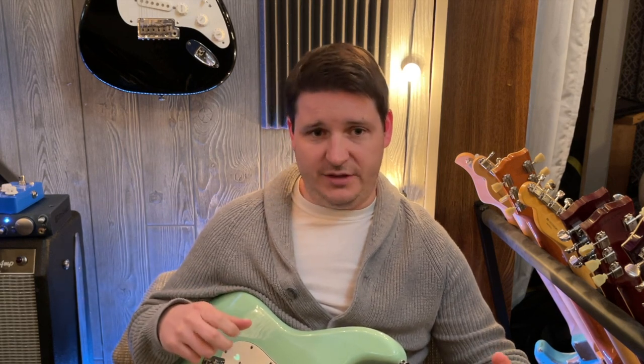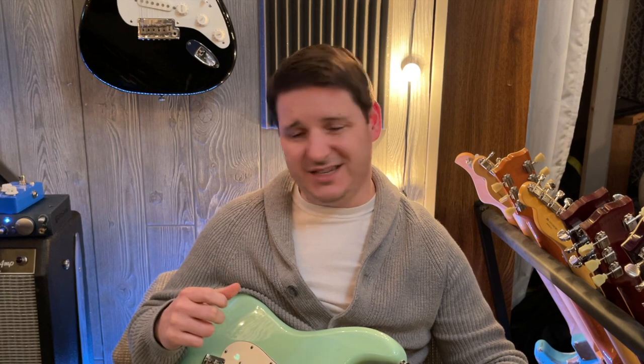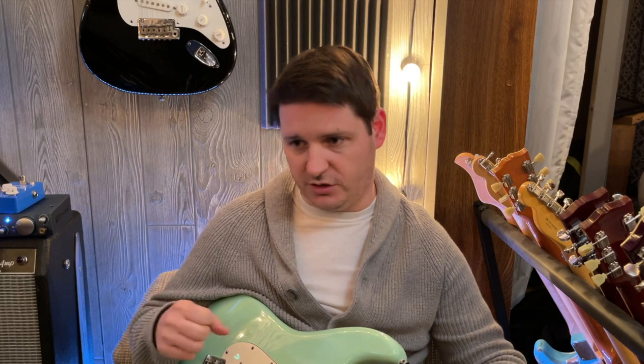There is a different sound there, especially when you're talking about cranking it. Now, this one you can crank a little easier, not just because of its wattage difference, but because of its smaller transformers than its bigger amps in this line, like the Super Reverb or the Pro Reverb. So you're going to get a little bit more breakup at a lower level with this amp than you would with something like the Super Reverb. Also, because it's two 10-inch speakers instead of four 10-inch speakers or 12-inch speakers, it's a bit more compact, a bit more gig-friendly, but still plenty big and plenty loud.